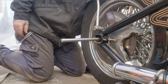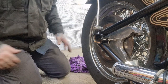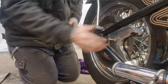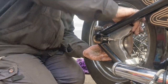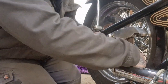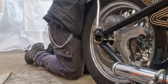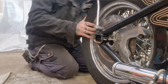So now pull that out, the wheel will drop down and you should be able to just push it forward a bit and get the belt off. It's not throwing itself at me - see if I can get this caliper hanger off, that might help. Get this spacer out - that might actually come off and fuck off out of the way while I'm messing around. Okay, now I can just about get the belt off. There we go, belt's off.